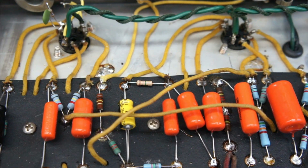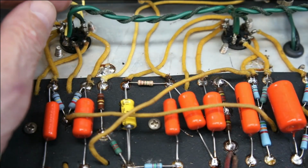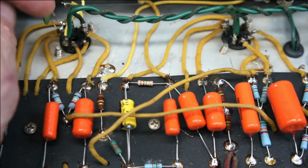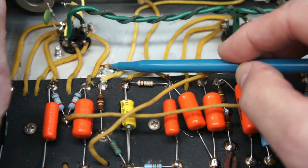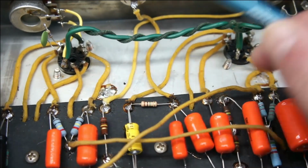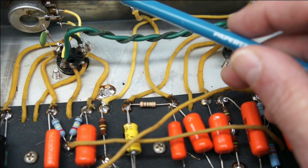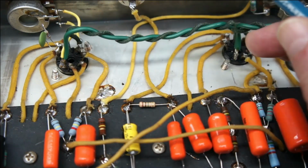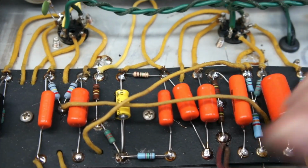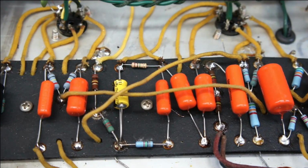In this case, another positive thing this guy did was make a double heater line. Originally these amps had a single heater feed and the heater grounded to the chassis, which creates more noise than you would normally expect. He had also put in a hum balance control. I don't like chassis being drilled, but it was there, it was done, and it probably reduces noise, so we went with it. So on a vintage amp like this, there's a couple of subtle things you can do to tweak it.